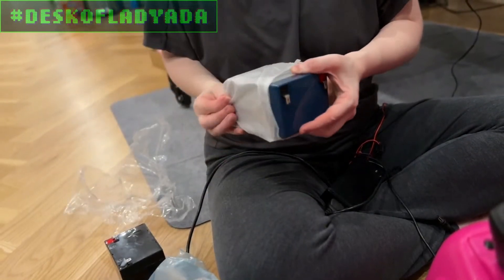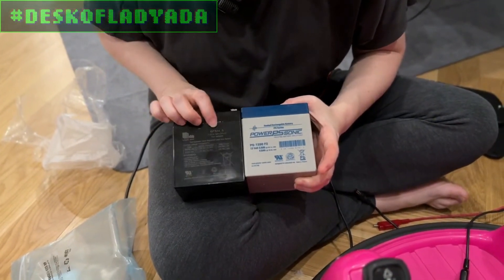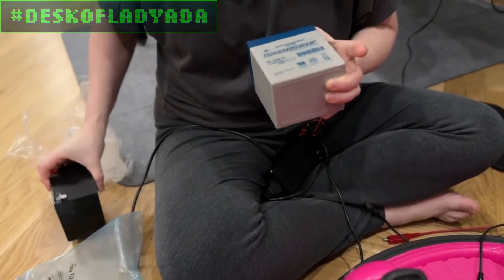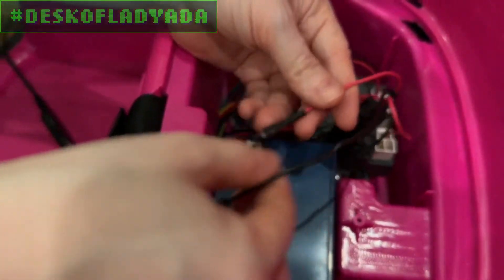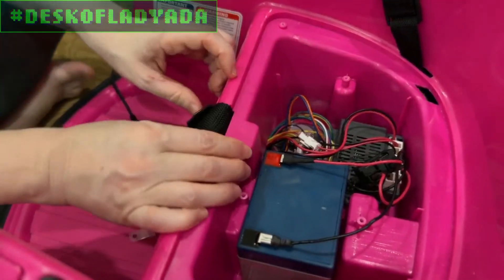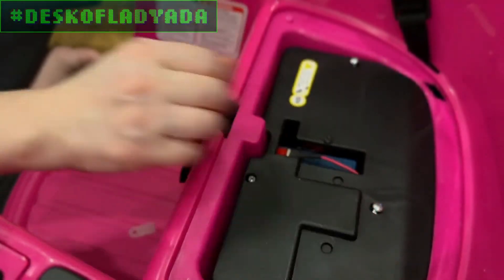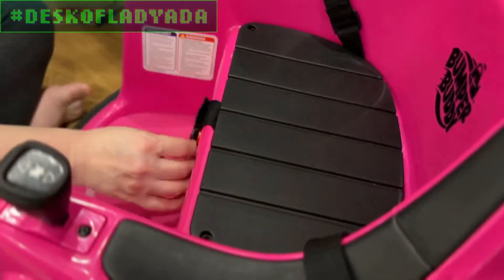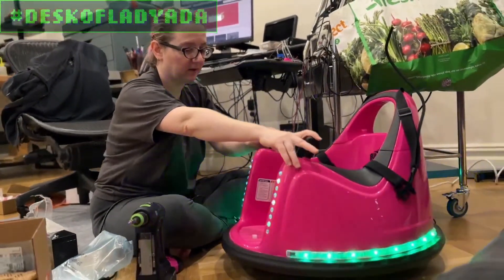This is equivalent size - turns out this is actually kind of a standard size. This is also 12-volt, 5 amp-hour versus the original 4.5 amp-hour, so it's exactly the same size. I can drop this in. For 20 bucks you can basically have a fixed setup. It's that easy. You screw this back in, don't forget this little protector clip, and put this on. You don't need the old power supply anymore. And then we're back in business.